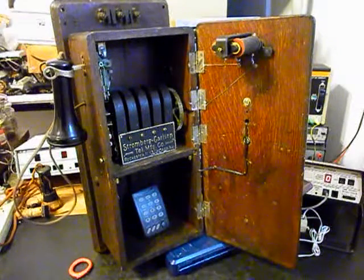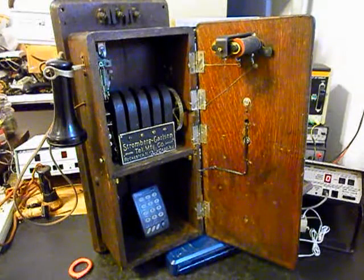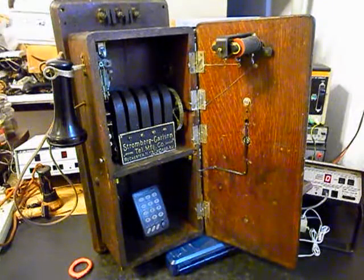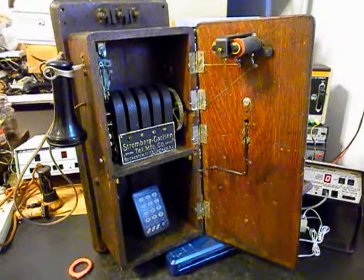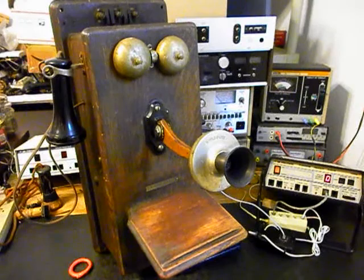We can hang up and turn our amplifier off. We also want to mention that there is a volume control on the right-hand side of the keypad, so the unit can be turned up and down. We also installed a modular port so Jane can simply bring any line cord, any length, any color, into this telephone and plug right into the modular port — it makes for a simple, easy plug-and-play connection. Now that we know this Stromberg and Carlson wooden wall crank telephone has been repaired and converted, we can return it to Jane. This is Dennis with A1 Telephone Service and Repair, A1 Electronics — www.a1-telephone.com, 618-235-6959. Thank you for watching and have a great day.